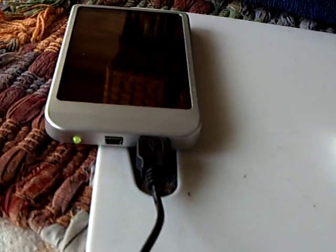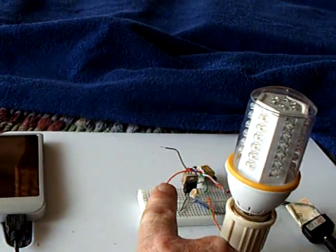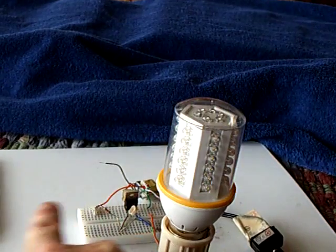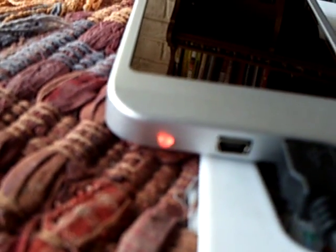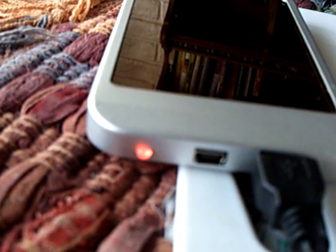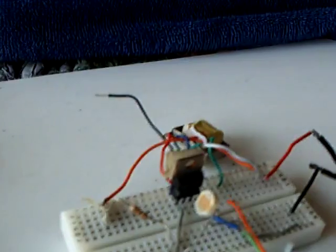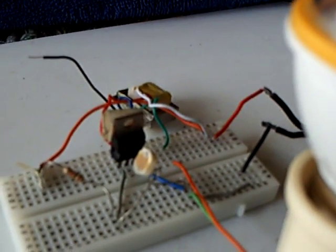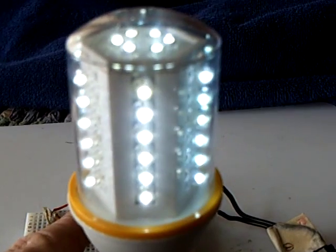The way this works is if I cover up the photo cell, the light comes on. Watch the little indicator light there go from green to red — that shows the power coming into and out of this little panel. If I cover the panel with my hand, this will actually be a light pink, which is some energy being drawn through this circuit, about 1 milliamp. And when it's on all the way, this is drawing about 70 milliamps.